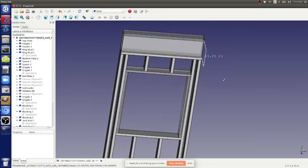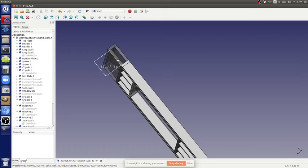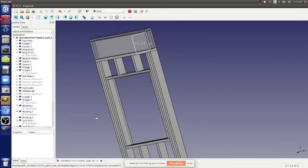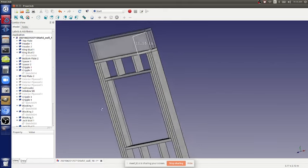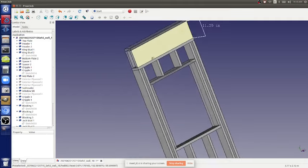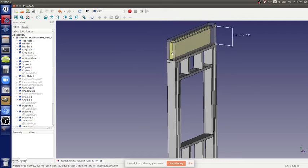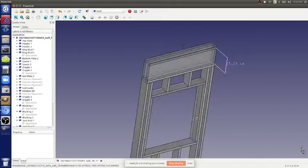If you have a 4-foot span, you need two of these. You actually need 2x10, but we are using 2x12 since we're getting rid of any 2x10s to simplify the bill of materials, and it's not too much more money. It's stronger. Since we use 2x12s in the roof and other places, we just said, okay, let's just use that. Let's not introduce any 2x10s, because altogether in the entire house, we don't use anything but 2x6, 2x4, and 2x12. So we just said, let's simplify the bill of materials.